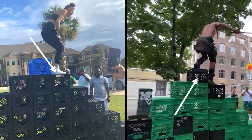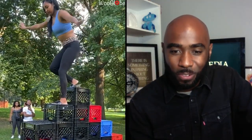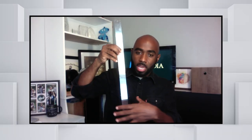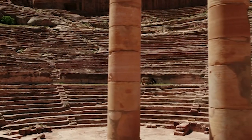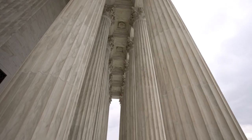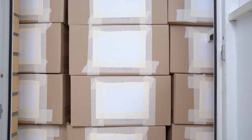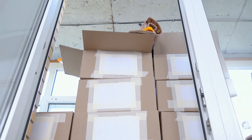So why is it here at the top of the pyramid where most people tend to fall off? Side sway. If you imagine this is a column, there are different ways a column can be fixed. It can be embedded in the ground — what we call fixed — it can't move sideways nor rotate. If we have that same type of connection at the top, this is your most stable column: fixed-fixed. The most unstable column is when you have something fixed or pinned at the bottom and literally no support up top, so whatever load comes up here has to support itself, and if it doesn't have the stability it needs, you're going to get buckling very easily.